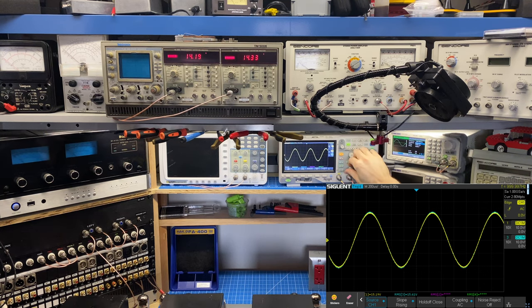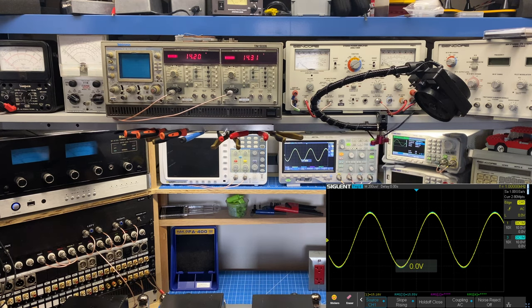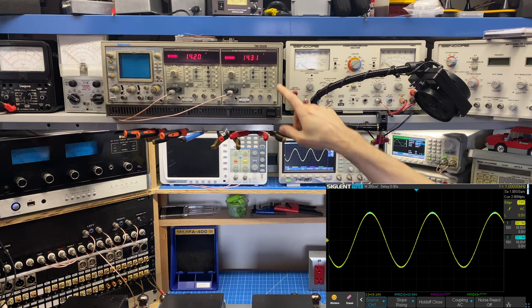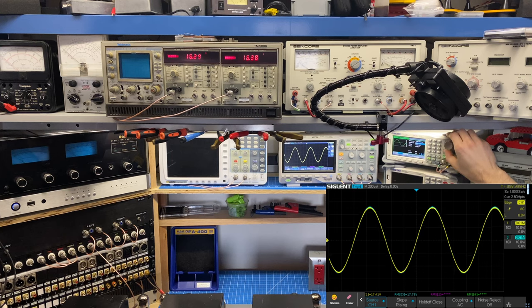What I have going on here is both channels are displayed, one on the blue trace, one on the yellow trace, and I just overlaid them so that we can see the channel balance. Right now I'm feeding about 2 volts peak to peak into the amplifiers, and they're putting out right around 14 volts RMS. I've got the volume control on both of them cranked up to maximum, and my channel balance is looking really, really good. You can see I'm very close here. So what I'm going to do is slowly raise my signal generator until these amplifiers hit clipping, and then we'll do a calculation on the output power.